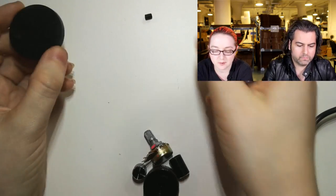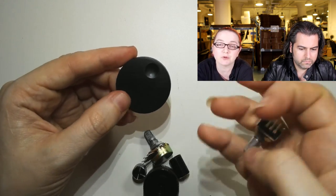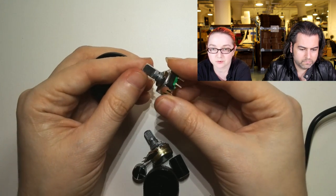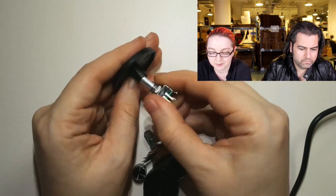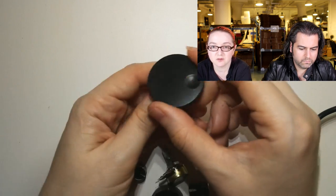This is a knob that I call the scrubber. There's no name for it, but I call it a scrubber knob because often it's called scrubbing through a video, scrubbing through audio, and the thing you would use is a physical knob like this. This is a knob that works with our rotary encoder. You need to have a D shaft for this. But it plugs right on, like this, and it press fits in. And then it basically turns it into a nice knob.